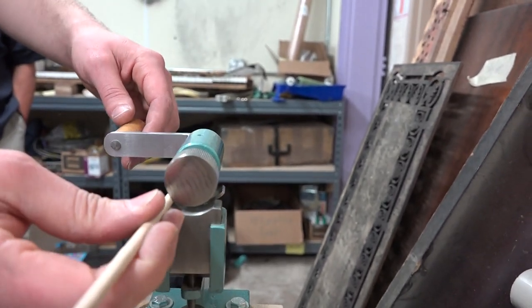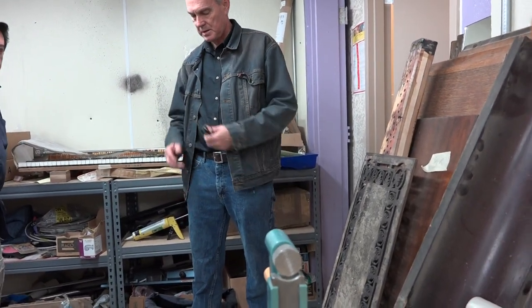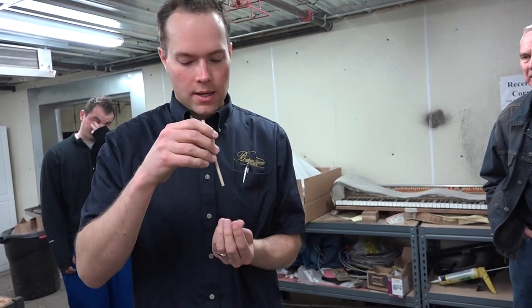Just run it through. What's the purpose of this? There are two purposes. You want to do it regardless, but we're also using it to buy a little bit more adjustability — to essentially squeeze the wood so that it's not so tight in the hole. When it's so tight in the hole we're a hundred percent reliant on the drilling, but when we've got a little bit of space we don't want too much space, because then we're relying too much on the glue.